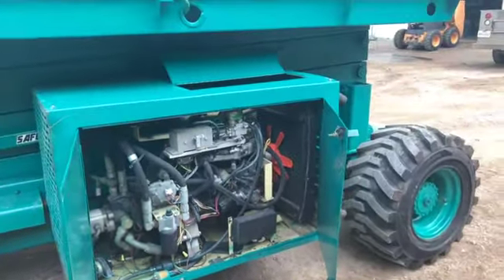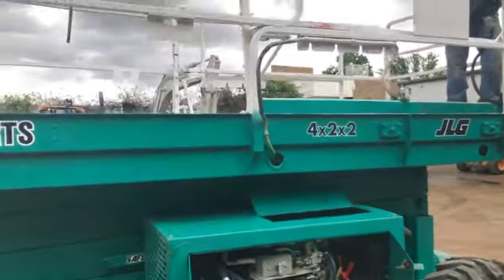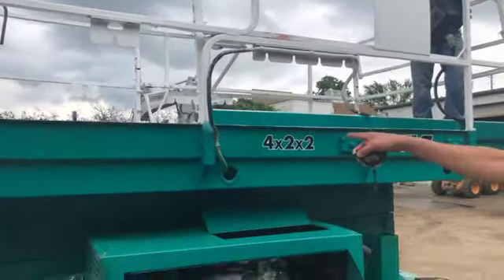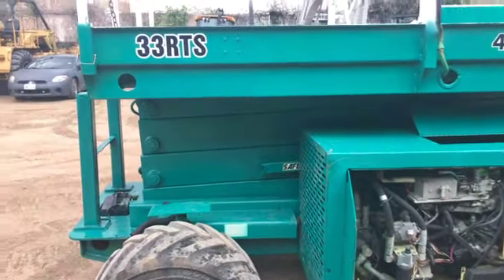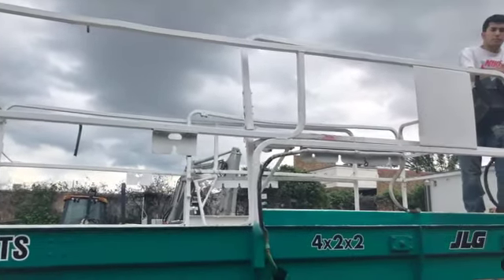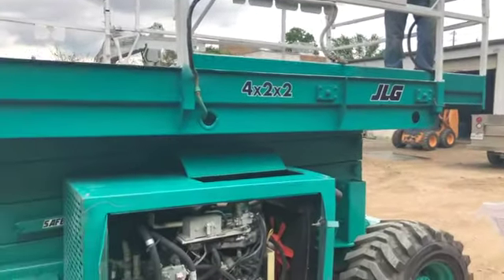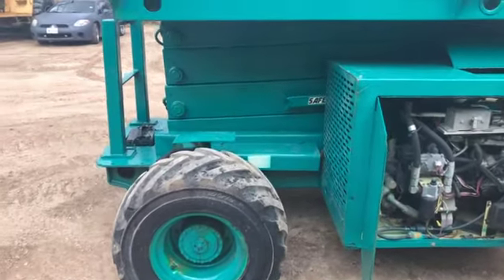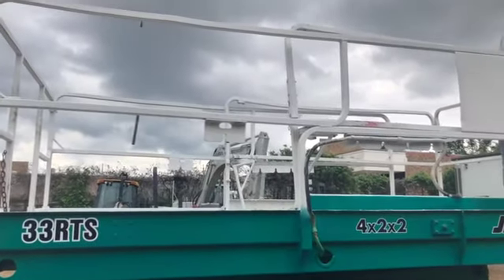This thing will travel like a billy goat. We had a 40 RTS and it was quite an amazing machine. The maximum weight capacity for the platform is 1,500 pounds. This machine will lift all the way to the top in 60 seconds and takes 35 seconds to lower. Once you hit 26 feet, you cannot move this machine — it will stay in place. You have to go below 26 feet to move it again.